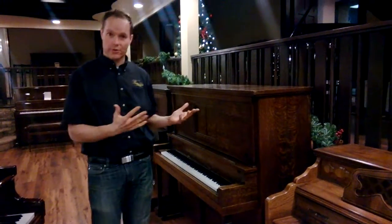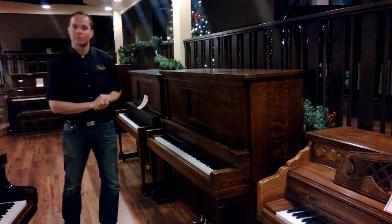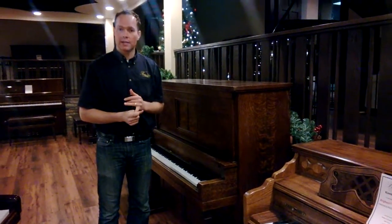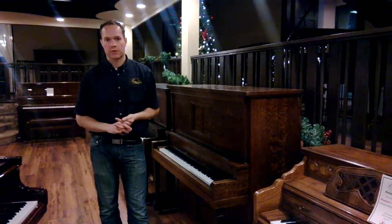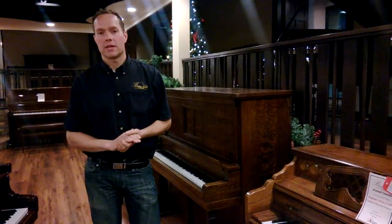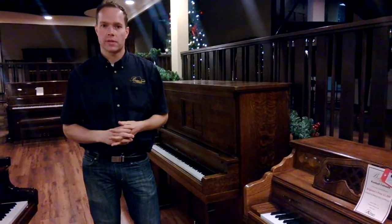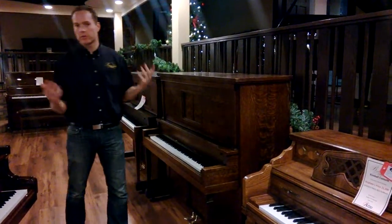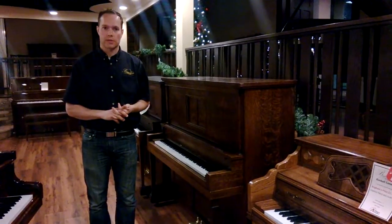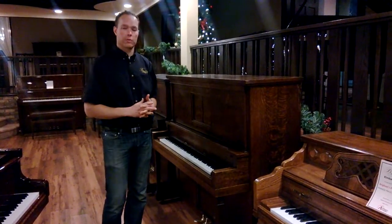And this piano had the works. So let me talk about it briefly and then I'll play it for you. Everything starts with cleaning. Any piano older than 10 years or so is filthy. Things get out of alignment, the hammers get flattened out, they get deregulated, it gets detuned. You might have loose parts, glue joints with issues, problems with the casters, bottom panel, pedals — there's always issues with all of those things every single time. Every project is a little bit different, but those are the basics.